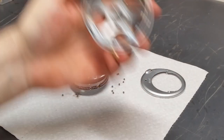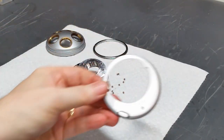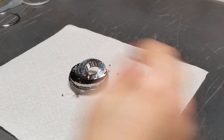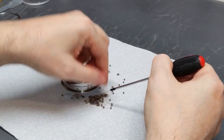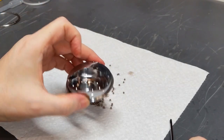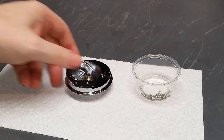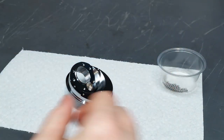I did a little off-camera work — cleaned this up, got the retaining ring cleaned up, and I took a little Brasso to the rear cover and that cleaned up nicely. The serial number never came off, but other than that it looks brand new. At this point I want to knock all these bearing balls out and wash them in a bottle of mineral spirits or acetone — either one will take this stuff off pretty well. I'm going to go off-camera and clean up the stationary base piece. The stationary base has been thoroughly cleaned and is ready to go. The balls were cleaned in mineral spirits, so I'm ready to apply some grease.